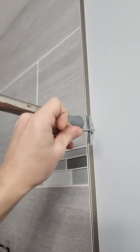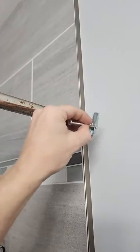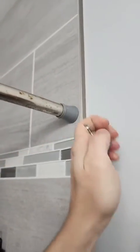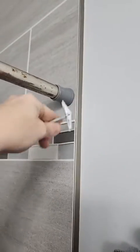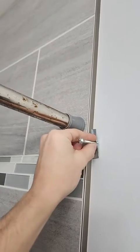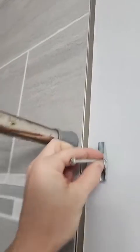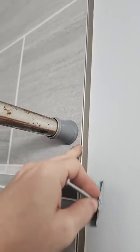That's going to pop open behind the hole, and you put pressure against it while it's in there, like pull on the screw that way, like out a little bit, maybe with your fingers or something, just to keep the toggle bolt tight against the drywall. That way it doesn't spin. You tighten this up, and that's going to grab onto that drywall back here, and it's not going to want to pull out nearly as easy as those screws pulling out of the drywall.